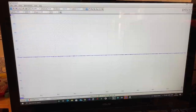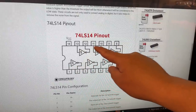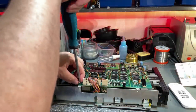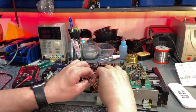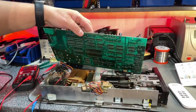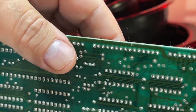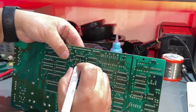Maybe that's it — we're on to it already. Three inverters worked, one worked, but the one in question did not work. I'm going to take that chip out and replace it. I'll need to take off the PCB. I check that the chip pins 10 and 11 are definitely connected. Here you can also see that massive transformer, which is the bulk of the weight of this drive. I marked the correct chip so I don't make a mistake.